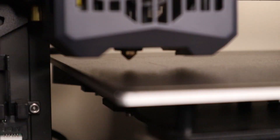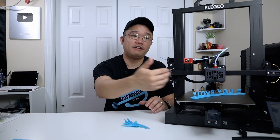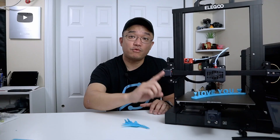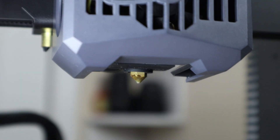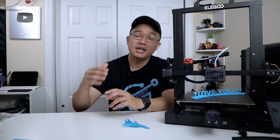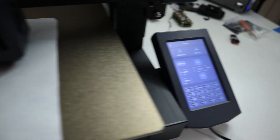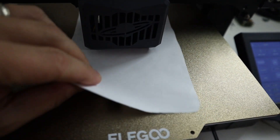One of the biggest features about this printer is the 16-point auto leveling from the nozzle. It's not like BL Touch or CR Touch where it's offset to the side by 20 millimeters or so — you are directly getting auto leveling from the nozzle itself, so it's spot-on precision. You only have to calibrate it once after you move the printer. It's a quick process going through all 16 points, and you can manually fine-tune it by sliding a piece of paper and adjusting the height. Once performed, all future prints will have those corrections applied.